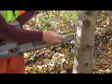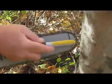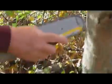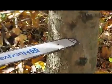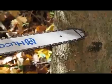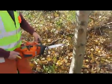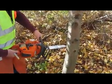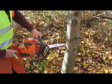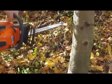We also have the top corner or quadrant, which is kickback, and the lower corner or quadrant, which is attack. Using the attack portion — no problem. Starting a cut with the attack portion is fine; when you're going to do bore cutting, you're going to start with that bottom quadrant of the nose. The top quadrant, on the other hand, if I was to start a cut with the kickback quadrant, I would get a kickback.